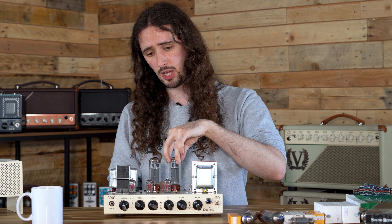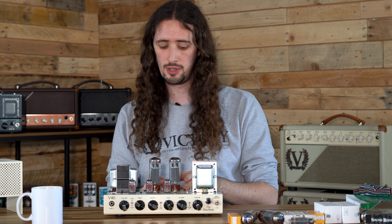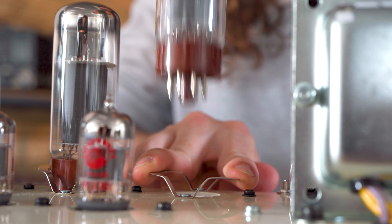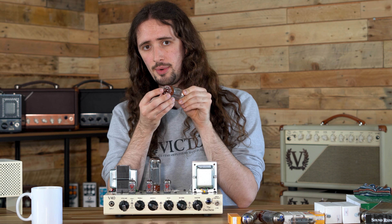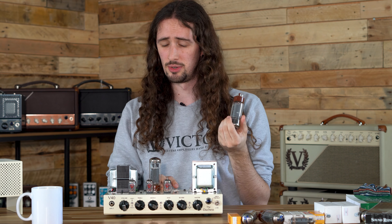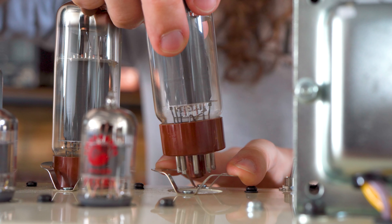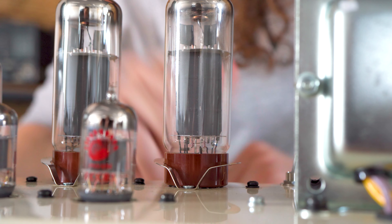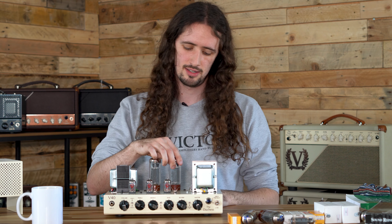On some occasions you may need to swap out your output valves. These will either have spring clips which sit over the top of the valve, or butterfly clips which sit at the base. Remove the spring clip from the top, or if you have butterfly clips like on this amplifier, use two fingers and push the outside, then use the gentle rocking motion mentioned previously. When putting the valve back in the base, you'll notice on output valves there's a keyway. The keyway shows which way the valve needs to sit in the base. If you feel any resistance, don't just try and push it in as you can end up doing a lot of damage to your amplifier. Align the keyway with the keyway in the valve base, push apart the butterfly spring clips, and gently rock side to side pushing in the valve. The spring clips will then push back into the valve's base keeping it nice and secure.